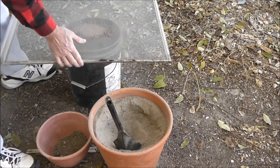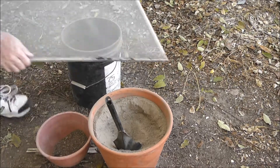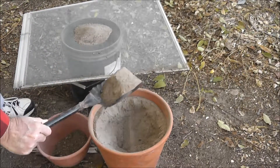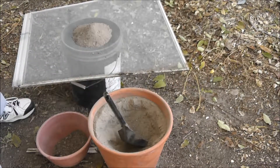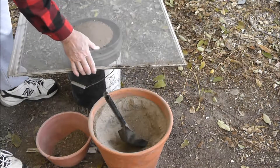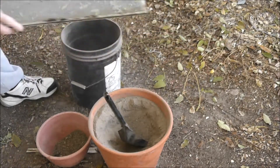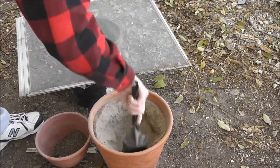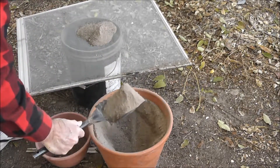Junk aluminum is aluminum cans, non-structural aluminum — that's sort of a no-brainer. You don't even have to worry about it when you go to do a casting, because whatever your casting is going to be is probably not going to be anything structural. In my case it's going to be ornamental — an ornamental sand casting. But when you smelt something that's had a structural use, it's going to have more than just aluminum in it.